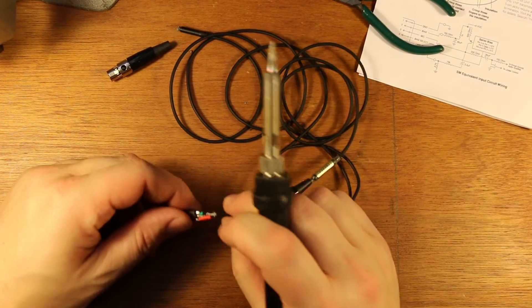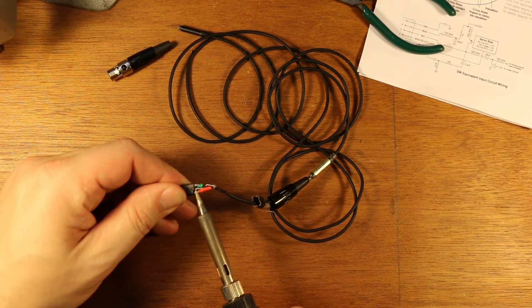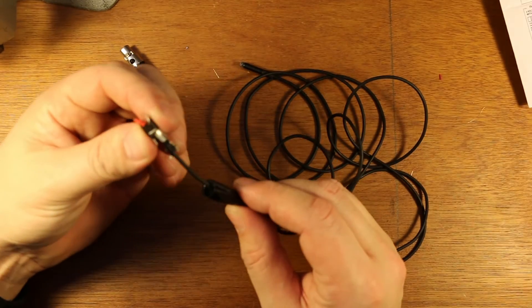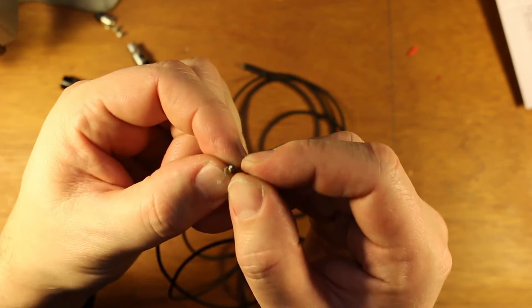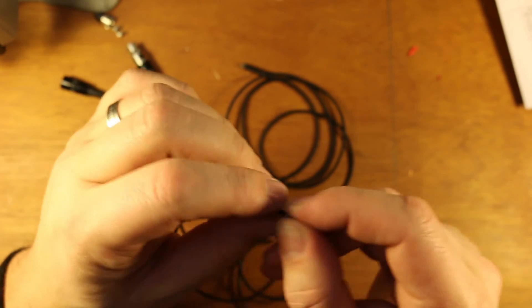Using the soldering iron, I'm just going to tap these to get them to pop back off. Now that the head of the TA5 connector is completely off, we can remove the rest of it — this part comes off, and this part too. These don't look terrible, but I'm going to re-cut them from scratch just to make them nice and clean.